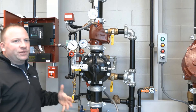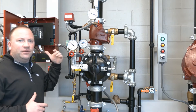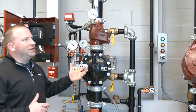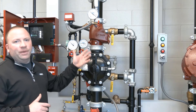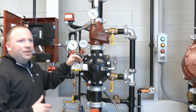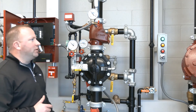After that, we'll show you the operation under fire conditions. On a fire condition we would get our detection first — in this case it's a smoke detector. Then as enough heat would build up in the protected area we would have a sprinkler fuse. When the sprinkler fuses, the water would come out of the system piping. So the detection puts the water in the piping, the water cannot come out of the piping until the sprinkler fuses, and then the water is released from the sprinkler itself.